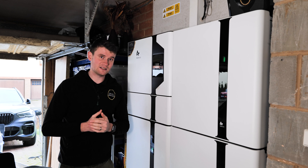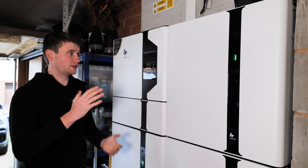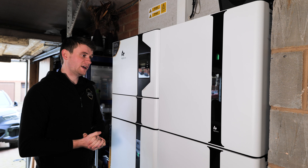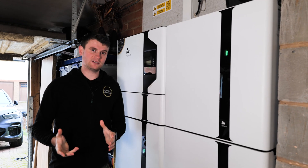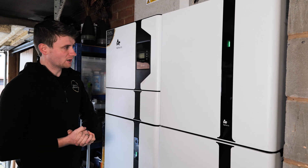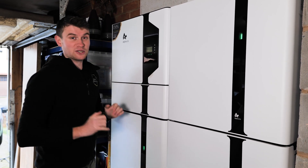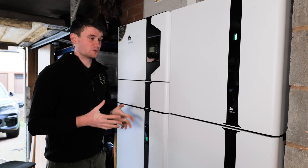Unlike a Tesla which switches onto battery in a power cut, we are limited to the 4.6 kilowatt inverter capacity, so we can't put kitchen sockets, car chargers, or electric range ovens on this circuit. In the event of a power cut the system internally switches and the batteries continue to supply the upstairs sockets and house lights. It's cheaper than a Tesla system but not as comprehensive — good if you just want to keep lights and some sockets on. We've got three indicator lights — battery, normal, and internet — all solid green, with no fault light present.